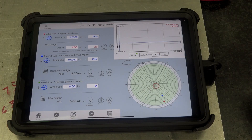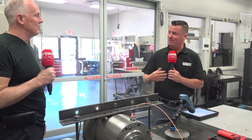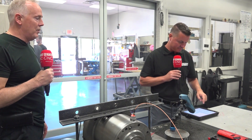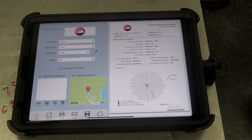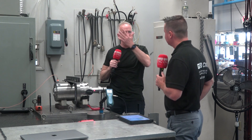We're going to see how well you did on your first go. Wow — looking at the spectrum, that one-times peak is so much lower now. It's essentially gone, and the vibration isn't there anymore either. All we did was add a couple of screws — and how long did this take? Five, ten minutes at most. Hit number three for our final reading, then hit the report button — it'll generate a beautiful PDF report of your results. You can take a photo of your setup, add the spectrums from runs one, two, and three, and email that report out to shipping and receiving to go with the spindle. And you're done.